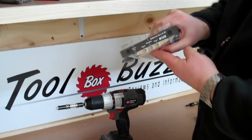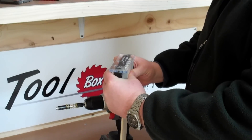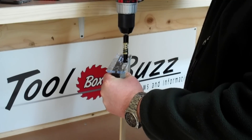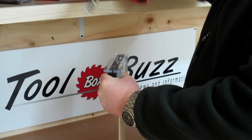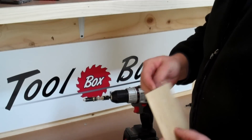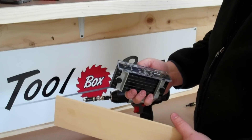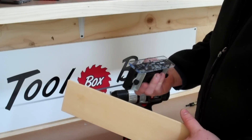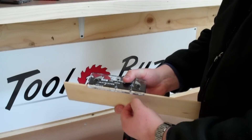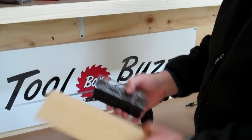Rockler also provides a template for drilling the end pin holes into the louvers. I've found I can actually just do it by hand — everything's centered. You use a different size drill bit that they send with the kit and just drill out both sides, and it's all set for the pins to go into the louvers. We'll also use this jig to install a hole at the center for the control arm — mark them positioned in the center and drill another hole through the face. That's all there is to prepping.